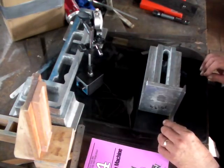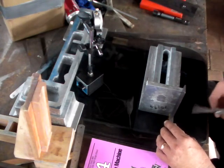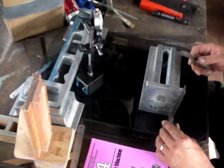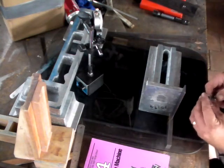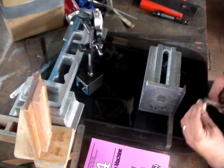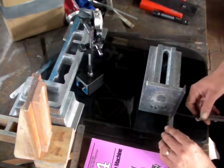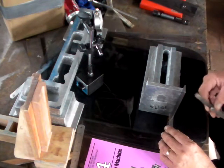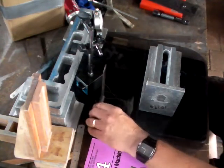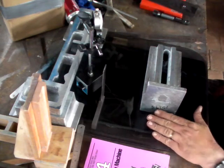To achieve that, I got the base right first with an engineer square. That's the thinnest feeler gauge I have, which is 1.5 thou, or 0.038 millimeters — I only know that because it's written on here. It won't go there, it won't go there. So I know that face is 90 degrees to that.